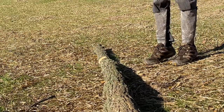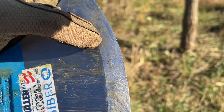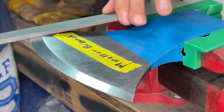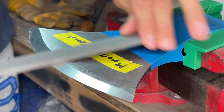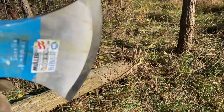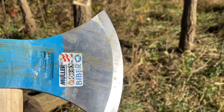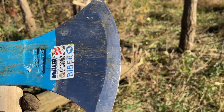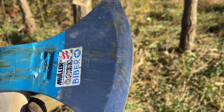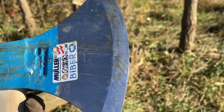Now it's starting not to cut so great. One thing I can see straight away is the steel does not want to hold up at a 20 degree flat. This is just a Scandi, basically — no secondary bevel. I was going to put a secondary bevel on there, but I thought why not give it a shot and see if it'll hold up. But it is just a little bit too acute. You could see the edges all crumbled. Put a secondary bevel on that and it'll chop just fine.